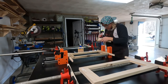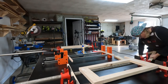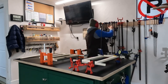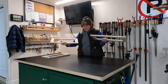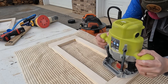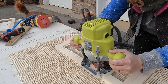Then I inserted some 3/8 inch fluted dowel pins into each of the holes that I drilled, and glued and clamped the frame of my doors together. Next, I needed to rabbet out a section for my glass insert. To do this, I used a half-inch rabbeting bit in my plunge router and ran it along the interior frame of the backside of each of my doors.